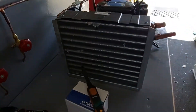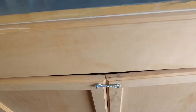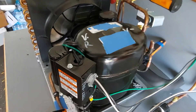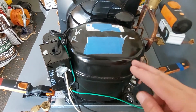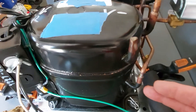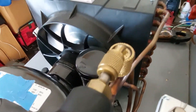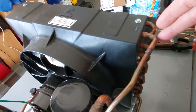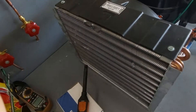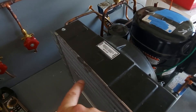I have access to wiring terminals to connect in different sequences. In the cabinet I do have my evaporator — I'm not going to open it right now because I'm trying to get it cold. The heart of the refrigeration cycle is the compressor. The compressor takes my low-pressure vapor coming into it, raises the pressure and the temperature, and discharges it into the discharge line. The discharge line runs across and comes into the top of the condenser. The condenser is a series of tubes and fins and we pull air across.